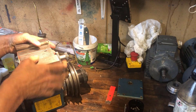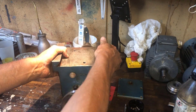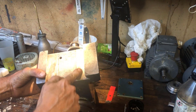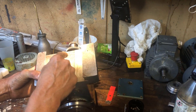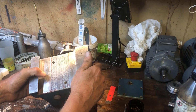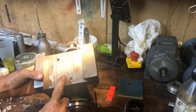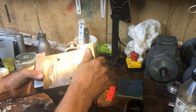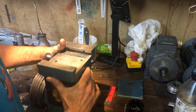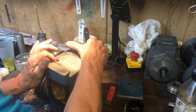From the underside, just to clean it up so you see — here we can see some of the scraping the Chinese have done. I'll have to test that. Given what I saw on the bed, I really need to test this. But this is not a sliding fit — it only needs a static fit. So it's not as important that you have as much coverage as you would on a sliding fit.